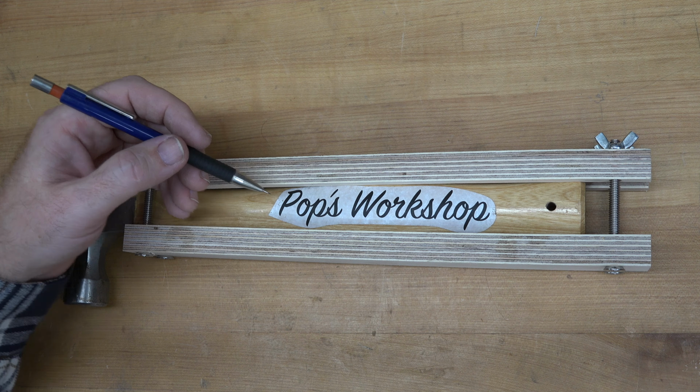Once you figure out exactly how to hold these pieces in, all you need to do is drill a couple of blade entry holes, and we're going to start cutting this. Just to show how tough of a drill it is, that last bit snapped off. Not a problem. I've got a beefier drill bit there now, and we'll carry on drilling these blade entry holes. And now we'll head over to the scroll saw.